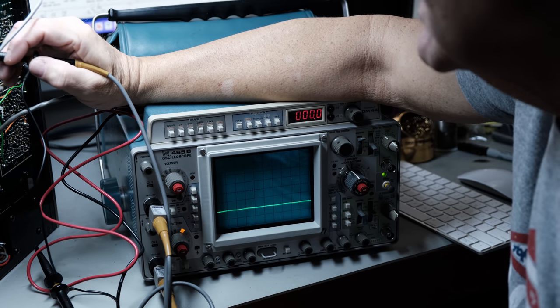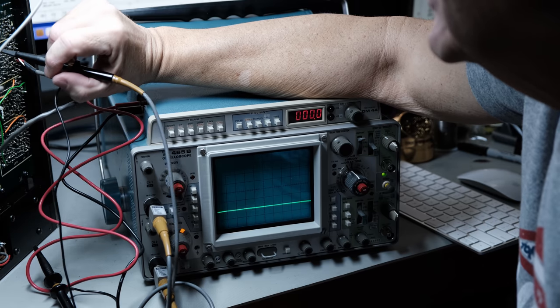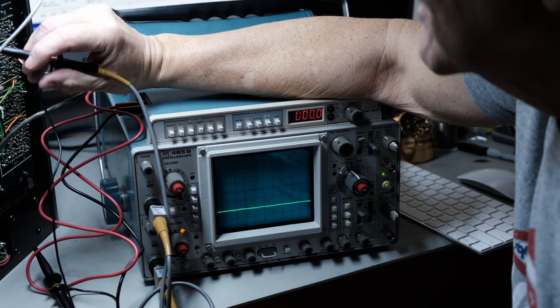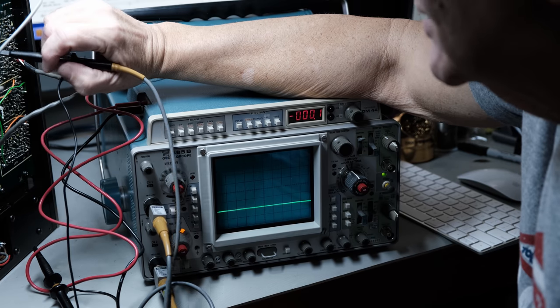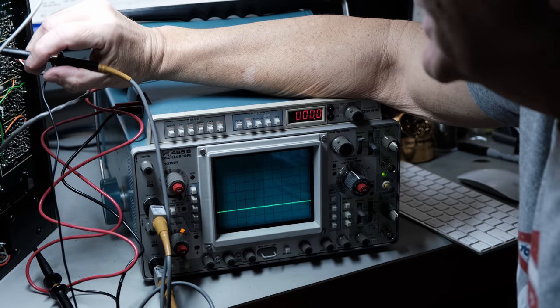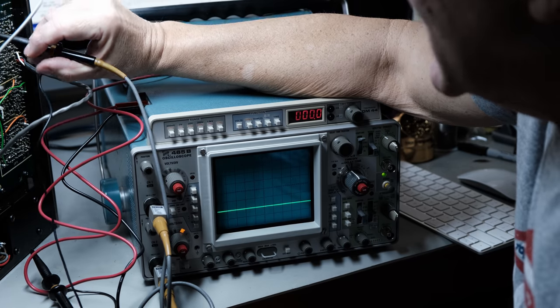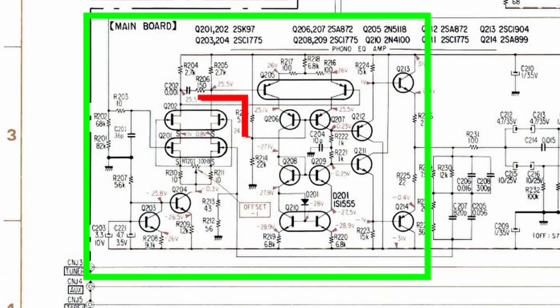That's what you want to look at first. Once again, I just want to say that you've got the best helper in the world here, the good channel. You can take a look. You're not sure what you're supposed to see. You take a look, and you say, well, that channel's working, so that signal must be good. And you go over to the bad channel and see what you have. So I'm going to look at those same two pins. That certainly looks different.